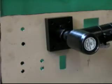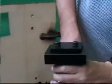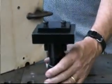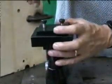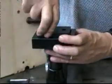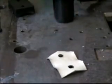And we check that our return valve is closed, and we simply pump along. And there's another one of them great Dandy Die openings. Reduce our pressure here. And out comes the slug. And that's using a Greenlee Quick Draw.